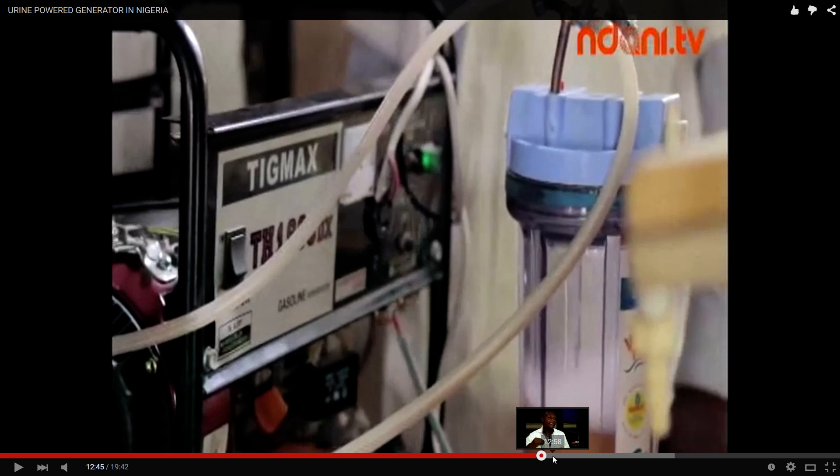It's a really great invention, so let's try to rebuild this ourselves — it's probably not too complicated. What these kids can do, we can do too. Urea is about 2% in urine and breaks down already at 0.37 volts, requiring 70% less power to break down urea-water solutions than KOH-water solutions. That's probably the key trick to getting this system self-running.